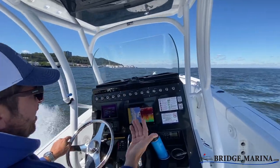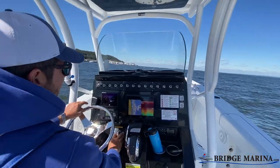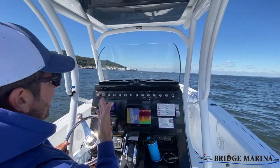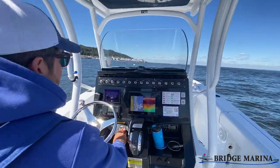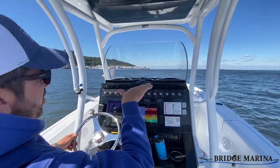The reason I would use these is if I had a lot of weight in the boat — we can actually see it right now. Kevin is taking the video and it's kind of making us lean a little bit left. So I can just tab down on my right, my starboard trim tab, and that takes the starboard side of the boat and leans it down so now the boat runs level.